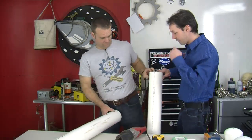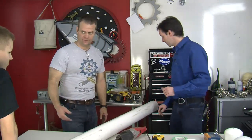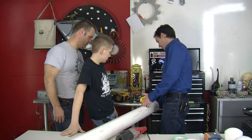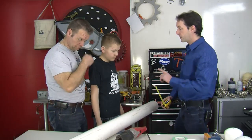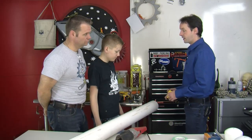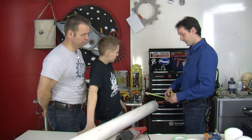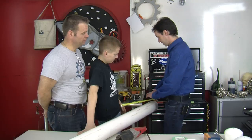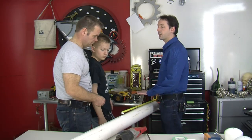Now that we've got our first one set aside, we're going to make another one. Our first one is a standard 4-to-1 ratio. Our second one, we're going to go 5-to-1 — so that's four and a half times five, which is 22 and a half. We'll add four inches, making 26 and a half, then one more inch: 27 and a half. Because you can always whittle off a little more later — I always add an inch.